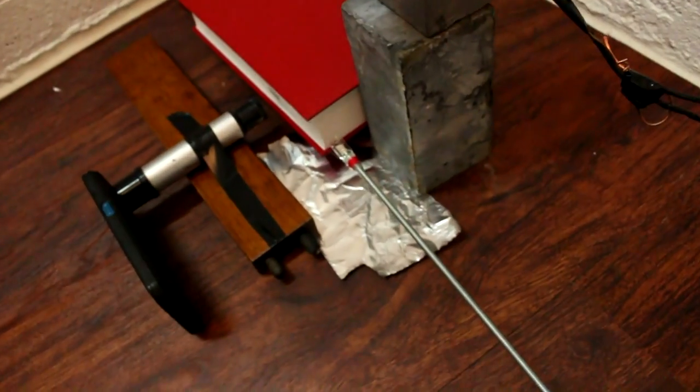That shouldn't hurt anything. So I reviewed the footage, and it looked like when I put the 50 microgram weight on the scale, it only moved down by 6 pages worth of distance on the paper ruler. And since I've calculated that the laser is at most going to produce the equivalent of 5 micrograms, just air currents of any kind is going to move that needle around more than the half a page I should expect.